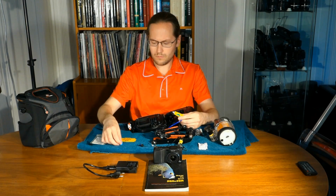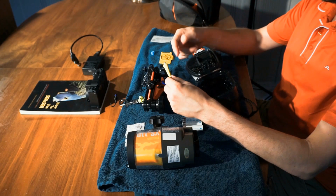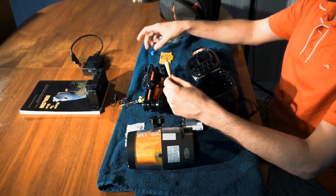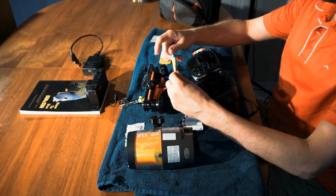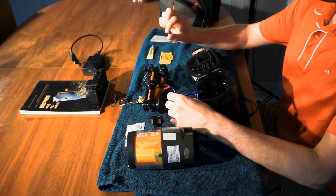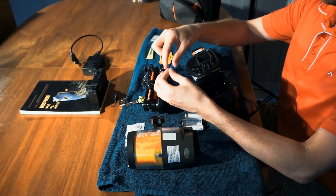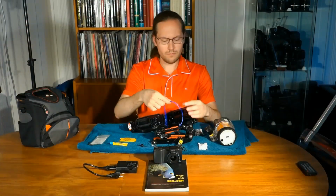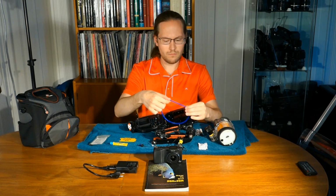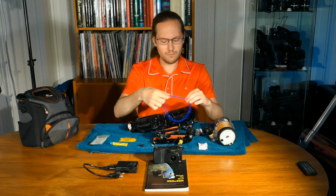When lubricating an O-ring, just a tiny amount of grease specified by the manufacturer is needed. Not even a pea-size little dollop will go a long way. Pinch the grease between two fingers and then pinch the O-ring between the two greased fingers, sliding along the entire length of the O-ring, dispersing it evenly. And in the meantime you can also feel for other imperfections.